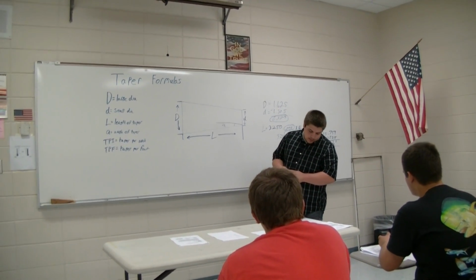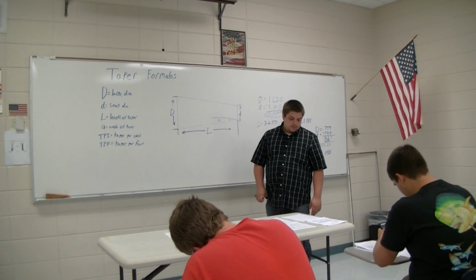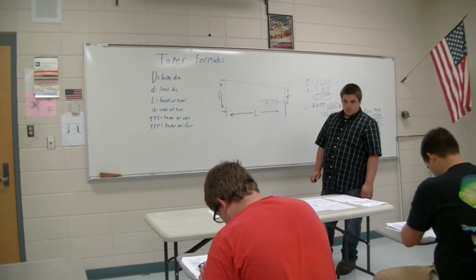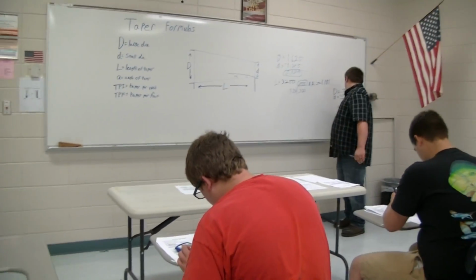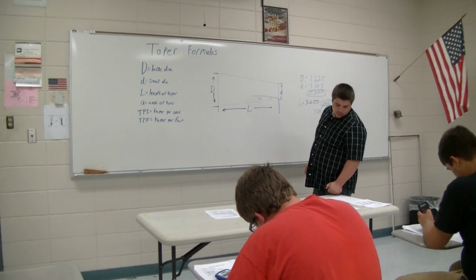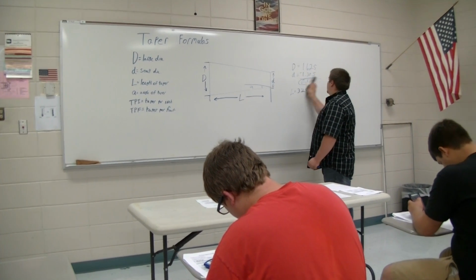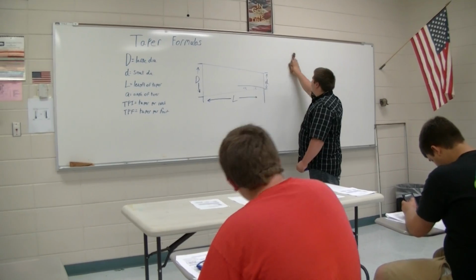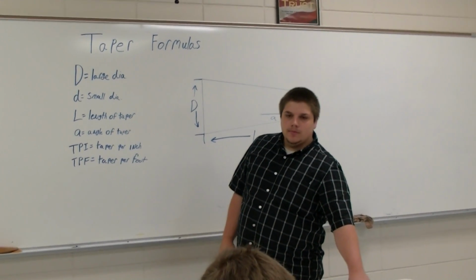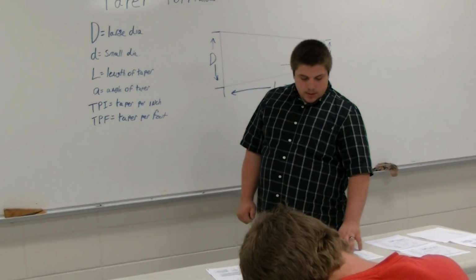I believe y'all got it. The next one's easy. Go ahead and just give me the taper per inch for the next one. That's right. 0.106. All right. And since your length is only 1 inch long, that's already your taper per inch. So all you'd have to do is multiply that number by 12 to get your taper per foot. I believe y'all understand it.